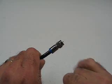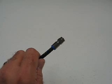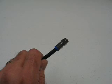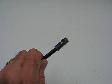After you've got the connector fully compressed and you verified that the O-ring isn't visible, there's no need to trim the center conductor because what we've used was a cable stop tool that ensures that the center conductor gets the proper length. For indoor installations, just remember to go ahead and fully tighten the connector hand tight. That's about in the area of 3 to 5 inch-pounds of torque, about 10 inch-pounds max. Anything more, you're going to damage your indoor equipment.